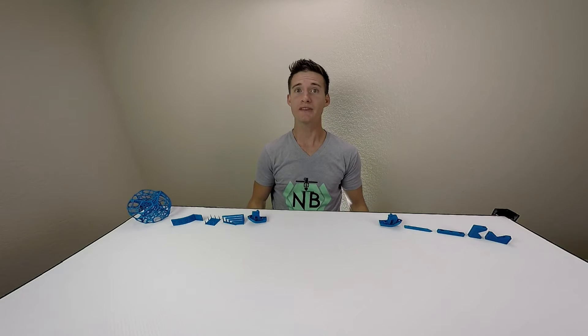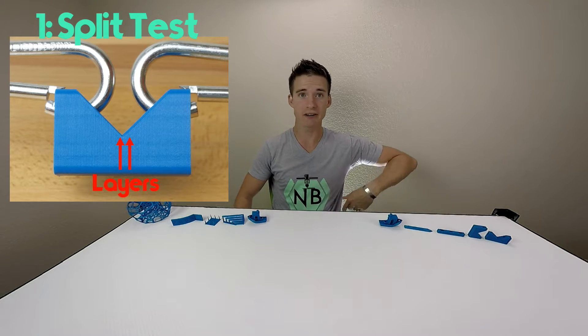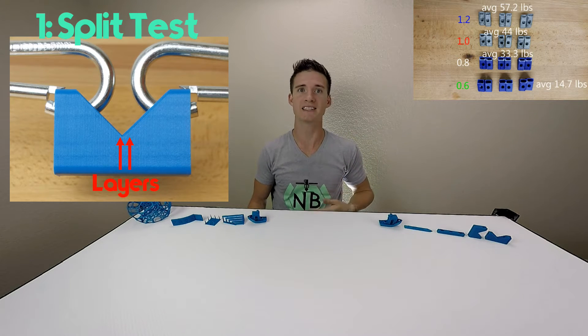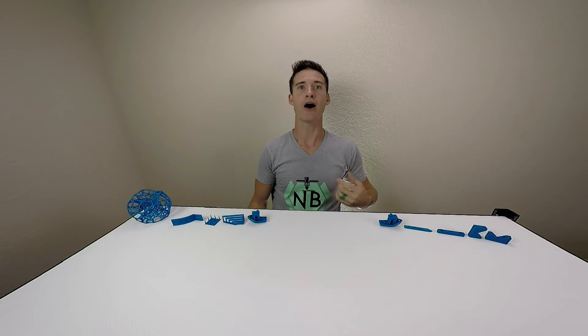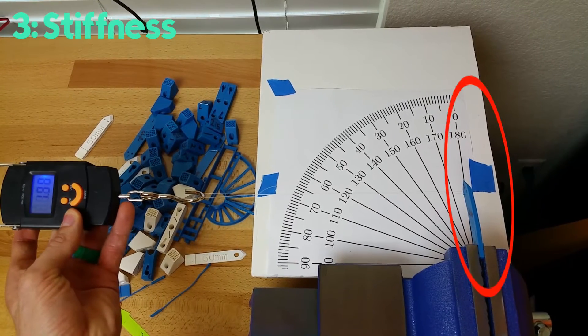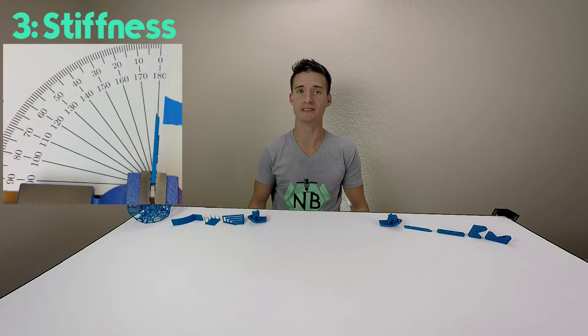The first two of the five mechanical tests will be using the same split test you saw in my Volcano hot end video — if you've not seen that, check out the video up here. It simply pulls the part in a way that stresses the layer bonding and not the material itself. I will be printing the yield test where the layers run along the height of the part, and it will show the point at which the material yields.